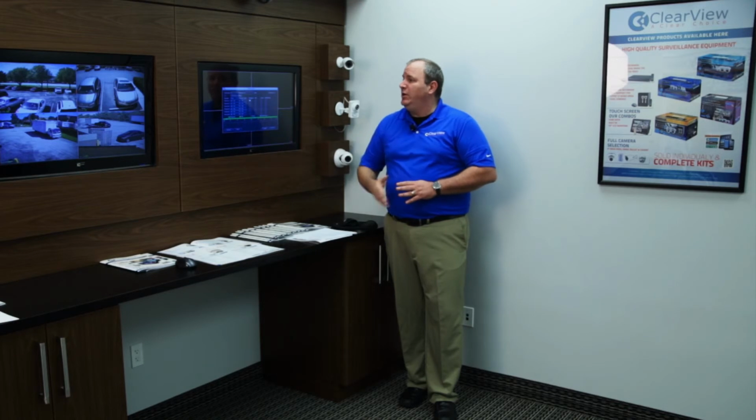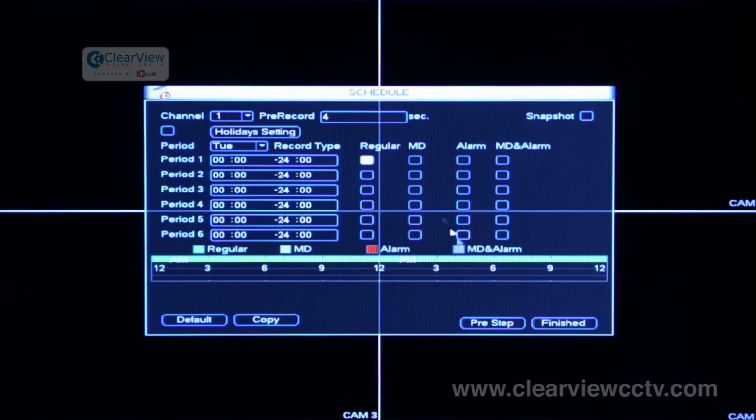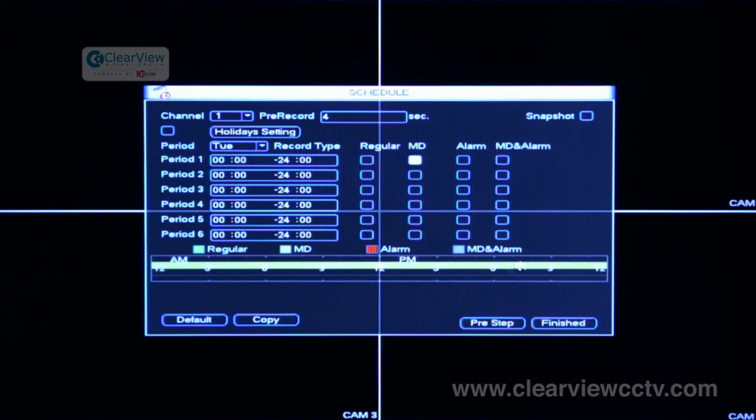If you want to create a more advanced schedule, you have 6 recording periods throughout the course of a day. The beauty of this schedule is it is not an all or nothing type scenario like other manufacturers. Each day and each channel, you can do a specific recording schedule. If you want to change it from regular recording to only recording on motion, not a problem. Uncheck regular, check motion, and you are all set. You'll notice the bar on the bottom has gone from green to yellow, and now it's recording on motion.